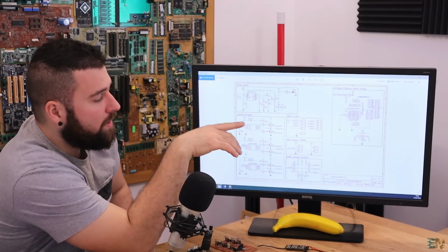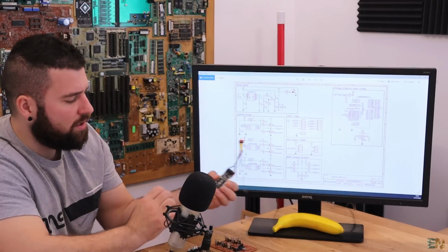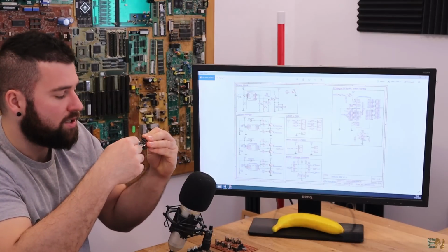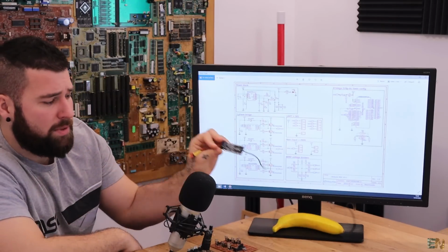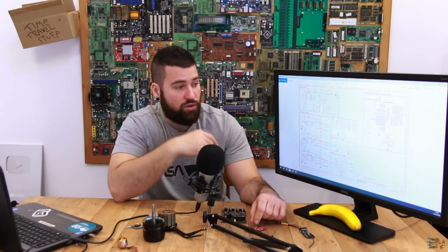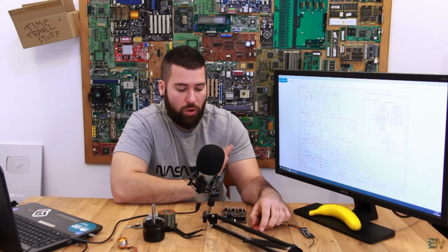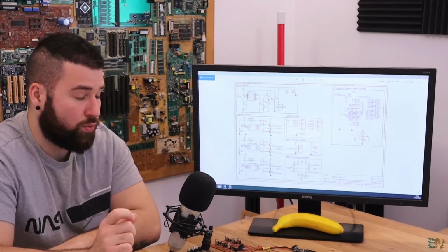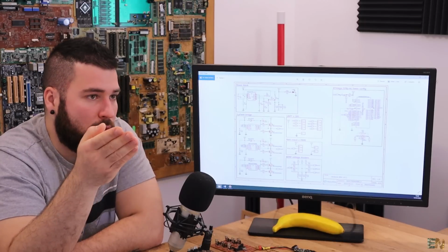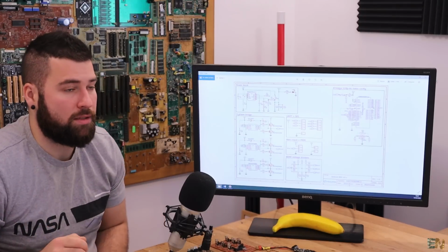And another thing that you should do is to make the copper tracks on the PCB a lot thicker, because as you can see here right now on the third version, the tracks are exposed, so I could add some solder in order to withstand more current. But even so, these tracks are only 3 mm thick, so we'll have to make bigger tracks because the copper thickness on the PCB is not that thick. So maybe with 100 amps or 150 amps, those tracks will burn out definitely. So what you want to do is to make the tracks a lot thicker and even expose those tracks so you could fill them with solder, and by that they could withstand a lot more current. So that's what you should do if you want to increase the power of this schematic.